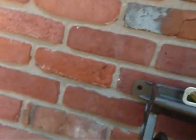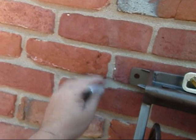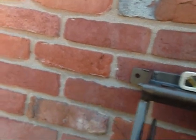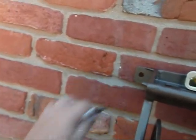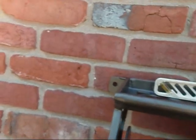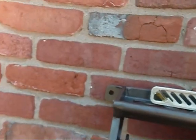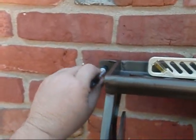I like to put things in one of these mortar joints, but over time that gives out and you're looking for your box to pull away from your wall. Same as with this hose reel — you're going to be yanking and pulling on this thing. That's why I went kind of overkill with the tap cons, so little nephew comes over, he can do chin-ups on this thing. Let me hit my brick joints here and we'll get after it.